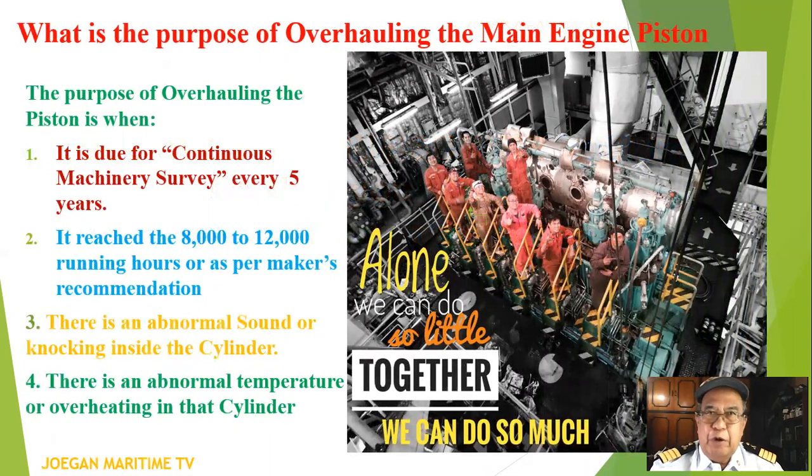What is the purpose of overhauling the main engine piston? The purpose of overhauling the piston is when it is due for continuous machinery survey every 5 years, when it reaches the 8,000 to 12,000 running hours or as per maker's recommendation, when there is an abnormal sound or knocking inside the cylinder, when there is an abnormal temperature or overheating in that cylinder.